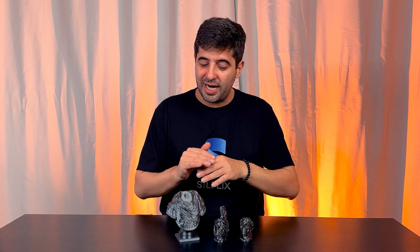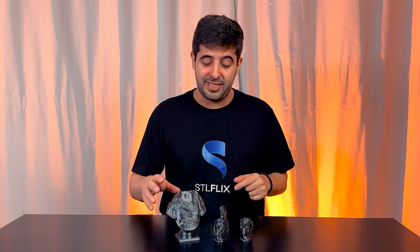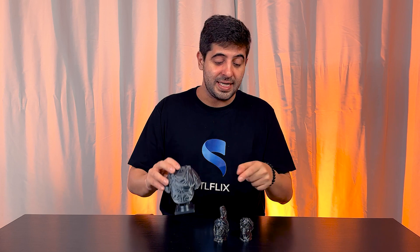And now the Centurion bust. This is a pretty easy model because we designed everything to be 100% support free, so the only tips I have here are productivity tips. For instance, you can print the column using a higher layer height because it doesn't have many horizontal details. But you will want to do a very detailed print on the bust and on the heads, because these have some very small details that will be much enhanced by a lower layer height — let's say 0.12 for instance.